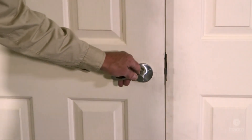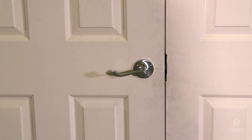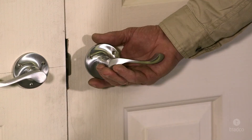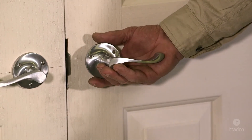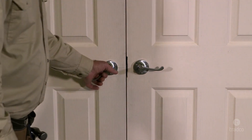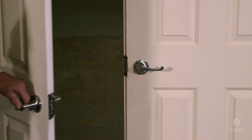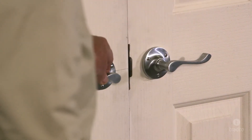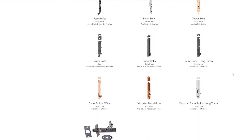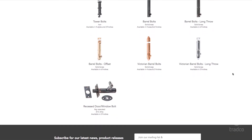Finally, check that the latch operates correctly and the door opens and closes freely. If you would like a uniform look to your rebated doors, we recommend installing a dummy set on the secondary door — for this you will need another door furniture set and 2 of our tailor spindles. We also stock a large range of regular and locking, flush, surface, barrel, panic and tower bolts to keep your double doors in place, and these can all be viewed on our website. Thanks for watching — make sure to check out our YouTube channel for more helpful videos.